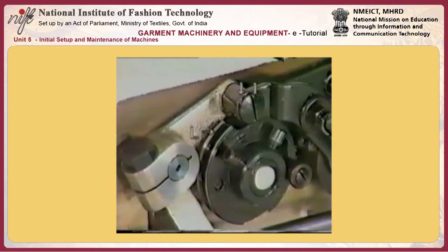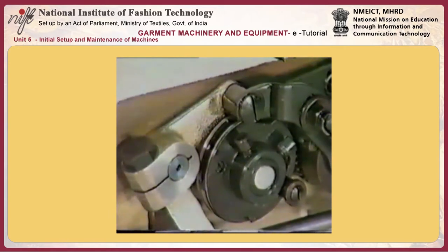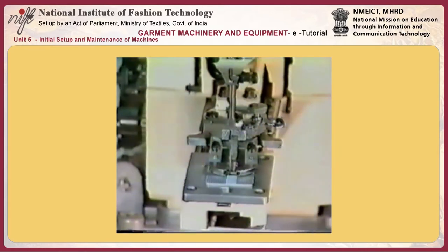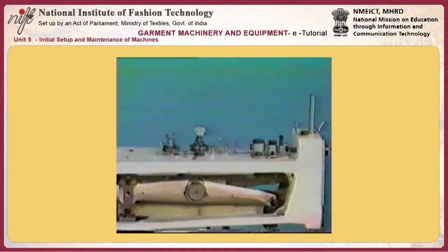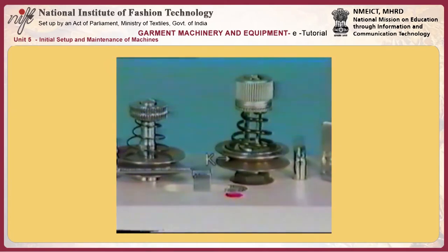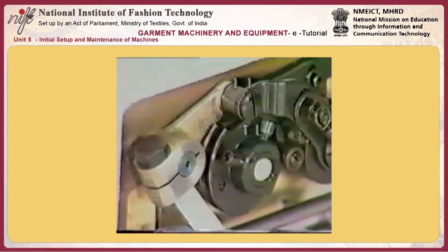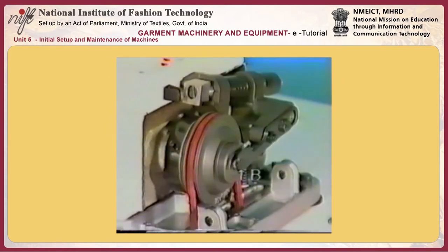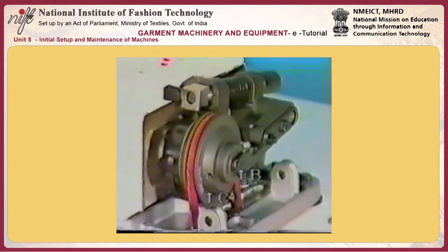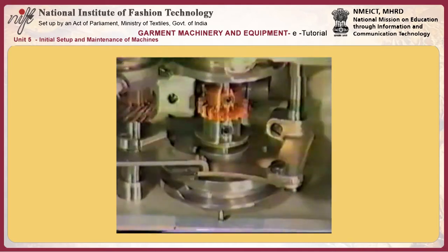Stop-motion tripping lever cam roller I is placed on the periphery of stitch-adjusting cam L, and the sewing machine starts running. Number 2, tension disc K releases thread tension once during one stroke of the needle bar. When stop-motion tripping lever cam roller I comes off the periphery of stitch-adjusting cam L, pressure-applying lever B makes pulley C run idle. At this time, button clamp lifting link O moves to the right, and button clamp forked rod P makes lifting plate Q come down.